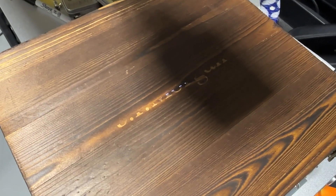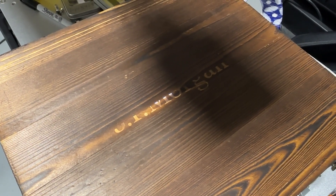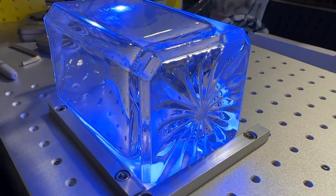We not only did some whiskey glasses, we did a decanter — the thing that you put the whiskey in. We also did wood boxes, and just ran it all on the UV laser because I didn't want to set up and mess up the CO2, since it runs tumblers all the time. This was really nice — just got it all done, ran it all on one machine. Doing six passes took about two minutes per glass item, but we just ran it all day and shipped it out for the customer.